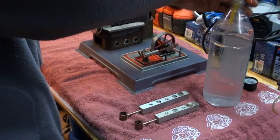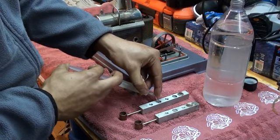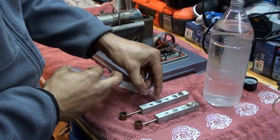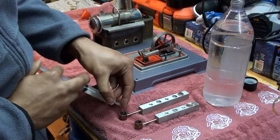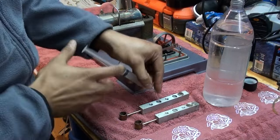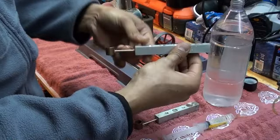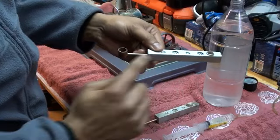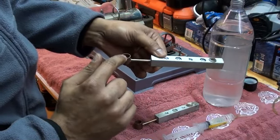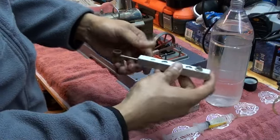It's taking about 8 milliliters of meth now. I should point out that you should never overfill it — if you overfill it, you could end up with so large a flame that it will be a problem. The main cavity is filled; I can see it from the vaporizing holes. I've left that virtually empty to give space for expansion, and this will fill up when it's hot.